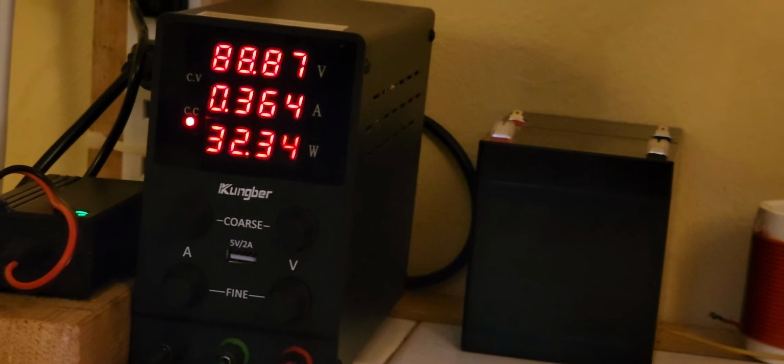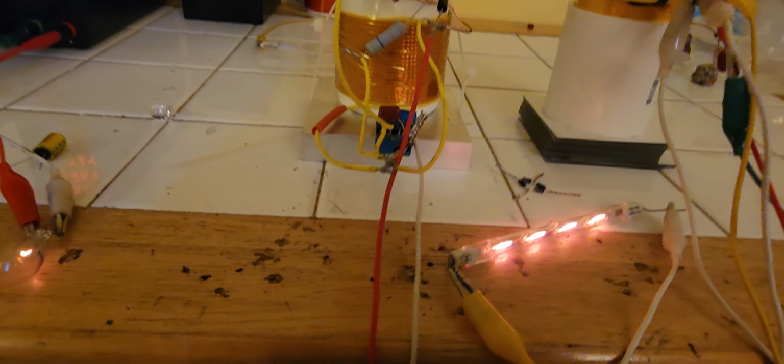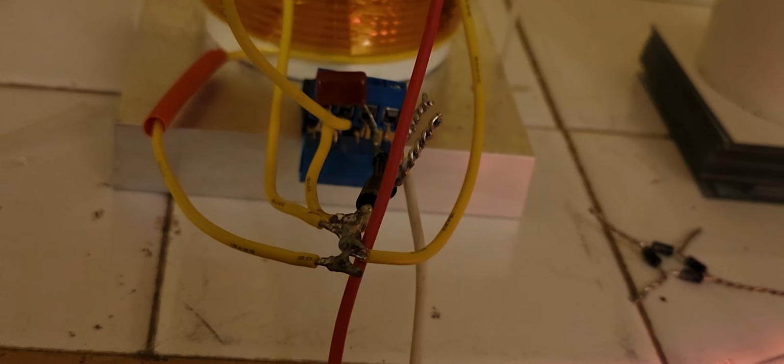And it's being run from the receiver coil. And what I did to have that run, I should have filmed this effect before I soldered it, but I don't want to get too close because it'll shut off the camera if I get too close to the transmitter. But all I did was I added a wire, this wire, which shorts out my extra bottom coil right to where the circuit, all the connections in the circuit terminate.